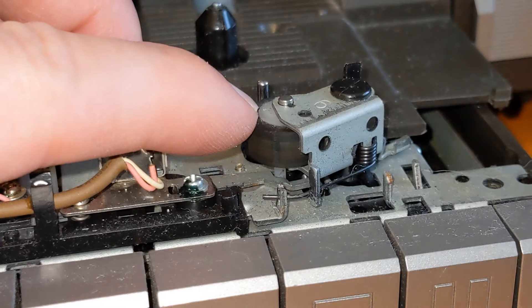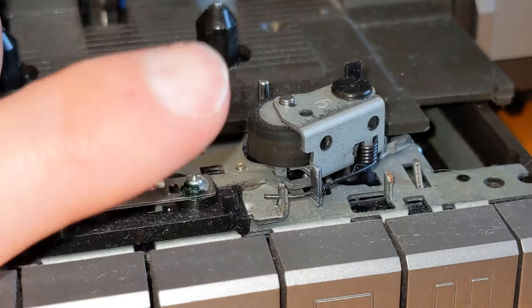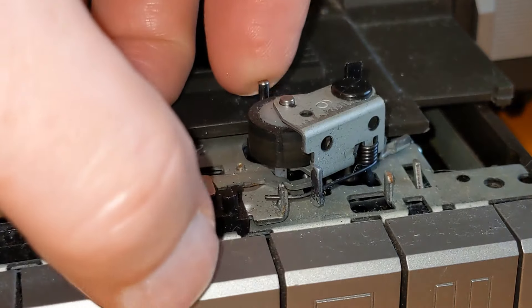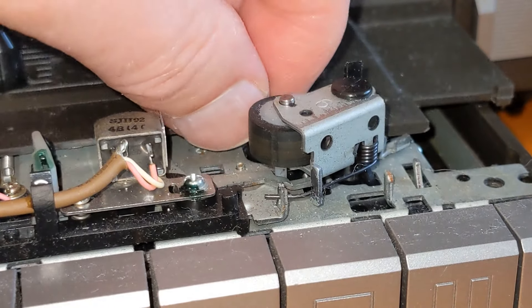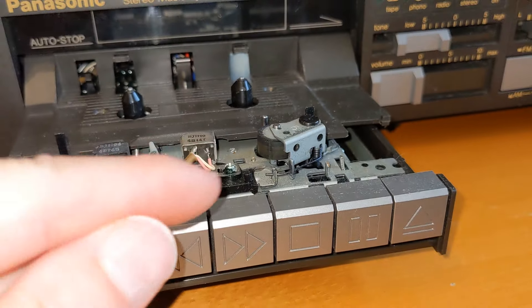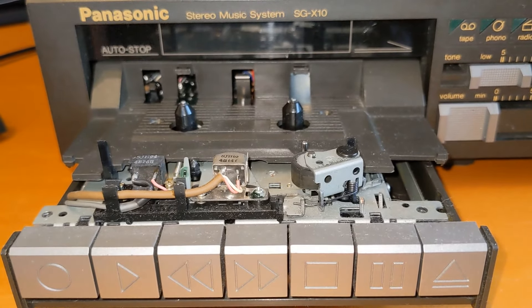The reason it's called Groovy is there's a groove in the pinch roller. There was a video — I'll put the other videos up top — it was called 'Punching Groovy' because the capstan was rusted and had a lot of rust coming out of it, and that was punching a hole in the cassette tape I was testing it with.